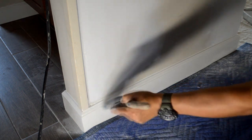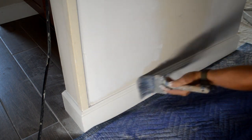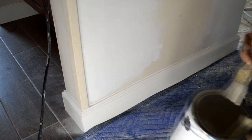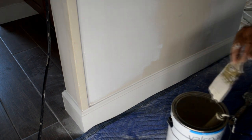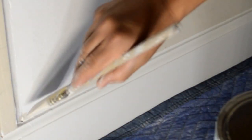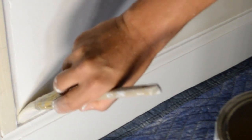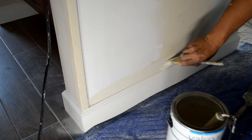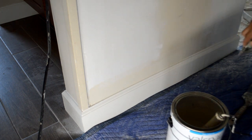Let's go ahead and work on the base molding. You want to clean that edge because you don't want all that dust falling down. If you have an older brush that you normally use to work in rough surfaces, that one will help you to just remove that dust — or buy a cheaper brush to use as a little broom to clean all those edges. Go ahead and load one side, especially the one that goes against the wall, with a little bit of paint, and then do the same thing.